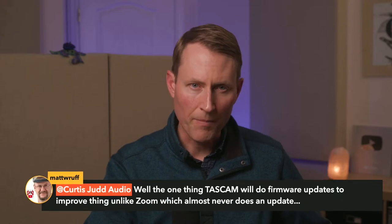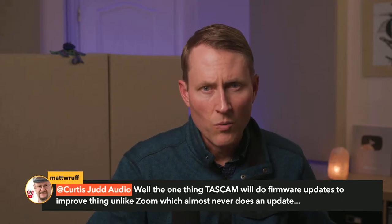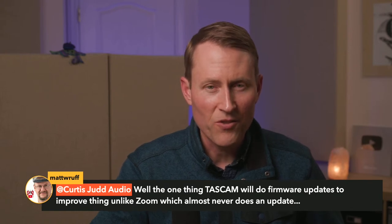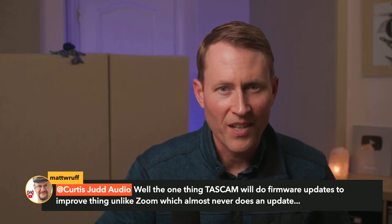But if you plug in something that is coming out mic level, say from a wireless receiver, and you set it to line level, your meters on your mixer are going to be way low. They're going to be down in the minus 50, 60 range, even when someone's yelling into the microphone. So that's where you would probably first start. Hopefully that makes sense.